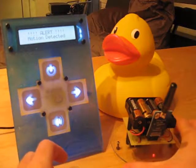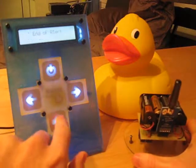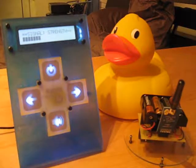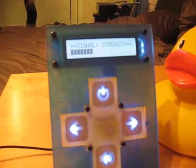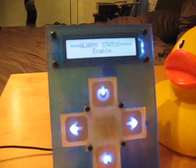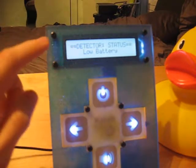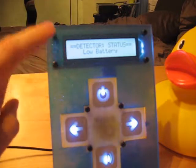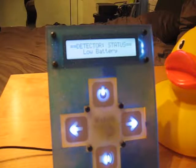The alarm will sound again and again because you can't have a detector with a low battery. The last functionality is that when the detector is off, the status of the detector will change because the base station is no longer receiving any frame from it. In a few seconds, the base station will show that the detector is disconnecting.